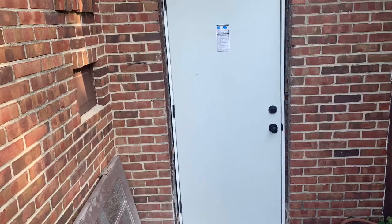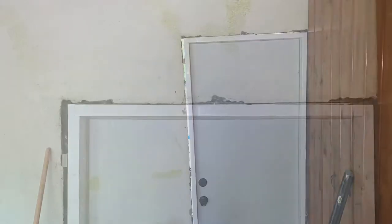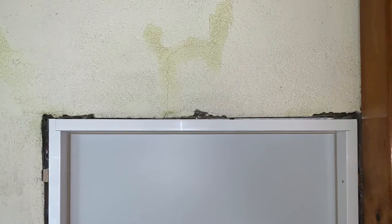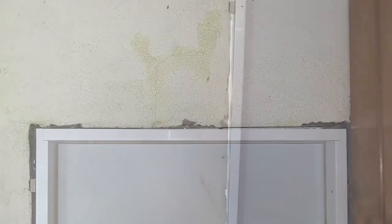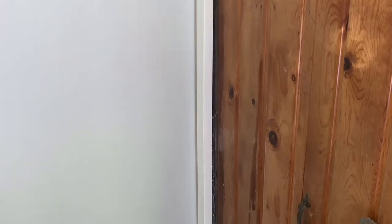The house is 115 years old, still in pretty good shape. As for this add-on, I'm not sure when it was done, but the inside of the garage is stuccoed. I shimmed the door so it was plumb and straight in all directions, and once I got it fastened into the wood fillers, as you can see through the shims, I hated to have to — normally I always roll the door seal up and hide the screws under it, but in this instance it just couldn't be done.